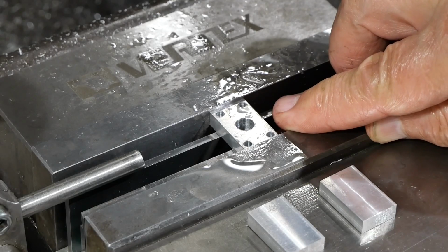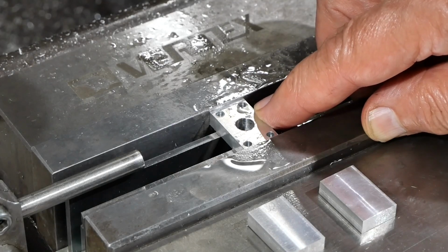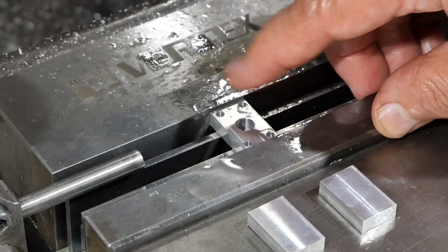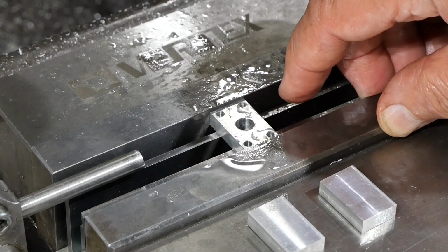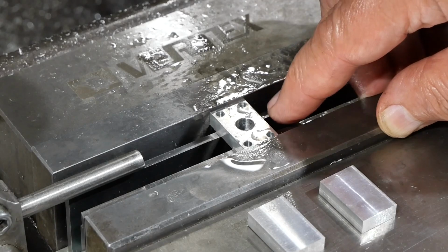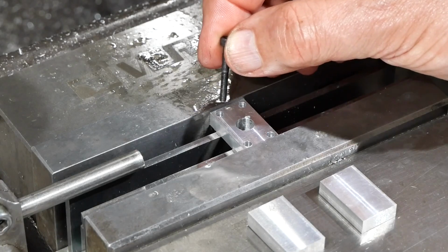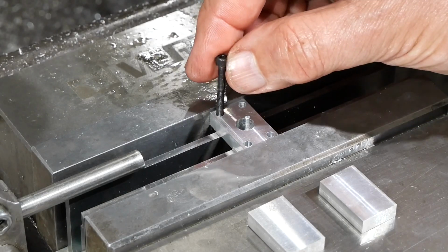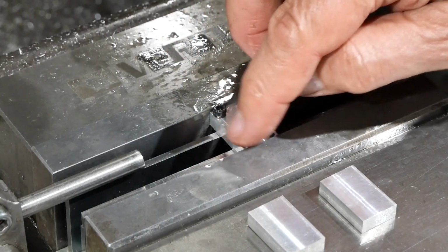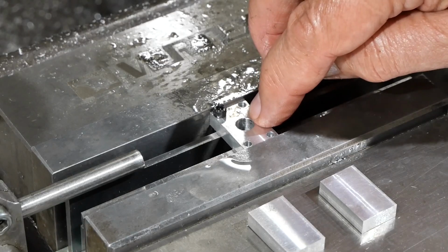So I'm working on the bits of aluminium which will house the intake and exhaust valves. It's a 3-layer assembly. The middle block's called the valve block, and it has 4 holes in it, which is common to all 3 layers. And it will also have a pair of holes going through left to right as you're looking at it, which will secure this 3-layer sandwich to the side of the cylinder head frame. Now the drawing calls out for some weird size, weird for me, I shouldn't poke fun. Anyway, I have 3mm screws, so that's what I'm going to use. Carefully positioning the holes, they're just inside the envelope, shall we say. And then there's a big hole through the middle which becomes sort of like the shared intake and exhaust port.